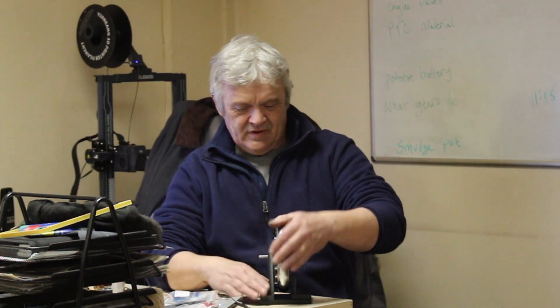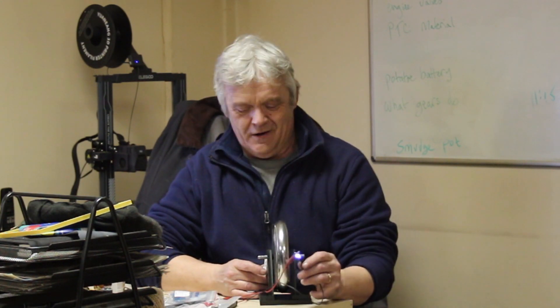And that's it finished — it really is that simple. We've got a whole bunch of magnets here: they're N52s, 5mm thick, 15mm across in diameter, and arranged north-south north-south for those who like those details. Now we're going to set this spinning — I warn you, you're going to get bored watching it spin because it spins for absolutely ages. I've got a coil and a couple of LEDs so we can watch them flash. And there she goes, generating away. It's a pretty good flywheel, spinning for ages and generating electricity, which is really cool.